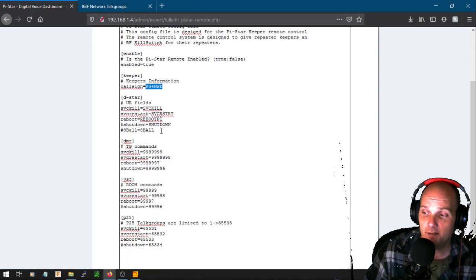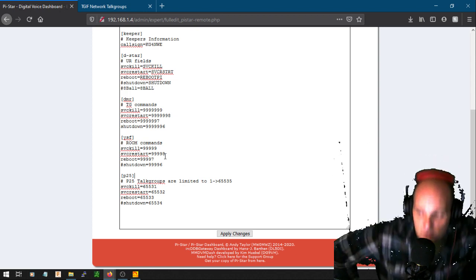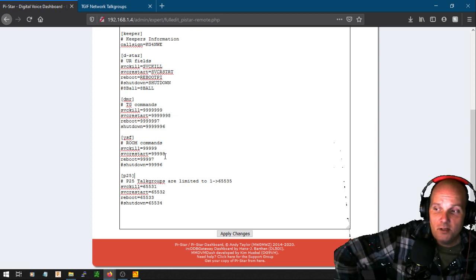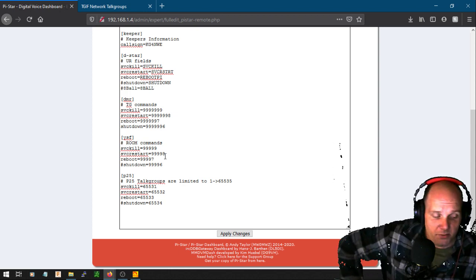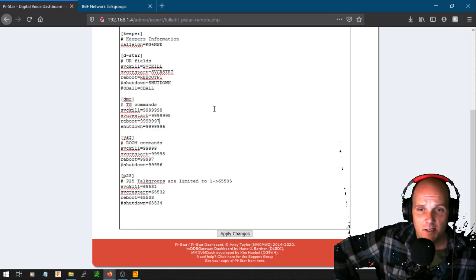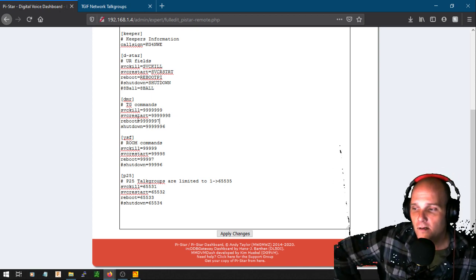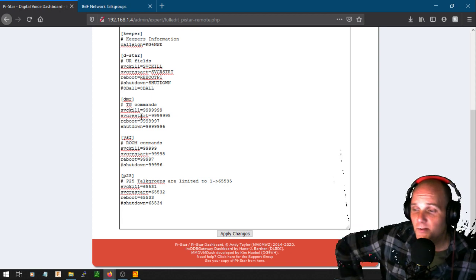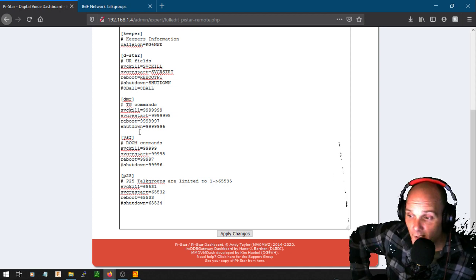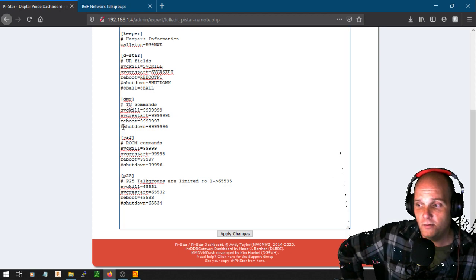And that is that. D-Star, DMR, YSF, and P25. Now, I don't use D-Star, YSF, and P25 all that much. I know a lot of people do. You can experiment with anything you want to. I use DMR mostly. I cross-link to the XLX servers and stuff like that through the DMR gateway. That's how I get on D-Star, just because it's simpler to me. I don't have a D-Star radio. Maybe one day.